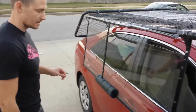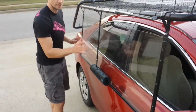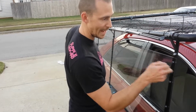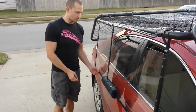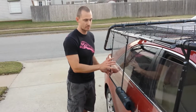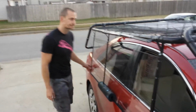Some of the more minor things that we did was that we designed a frame for the polycarbonate, because when you first get the polycarbonate, it is very loose and wobbly, and you get a lot of play. So we had to create some kind of a frame for it. So we created the frame and we put the angle iron at the bottom, and that's really stiffened it up so it's acted pretty solid so far. Only a slight bit of wobble you can really get. And as you can see, that's not even really wobble, that's just movement from this hinge to that hinge.